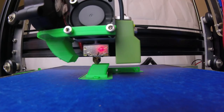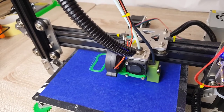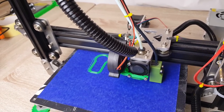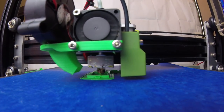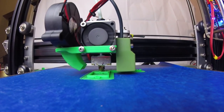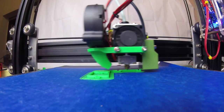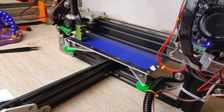I'm actually using it even more often now and it's been very reliable. In the beginning it was a bit of a different story. I never really had issues with the software side, but I did have to invert the extruder motor and install the auto-leveling sensor. The auto-leveling sensor that comes with it is not great — it's insanely difficult to install and get working just right. I ended up using the auto bed level sensor combined with manual bed leveling to get a perfect result every time.